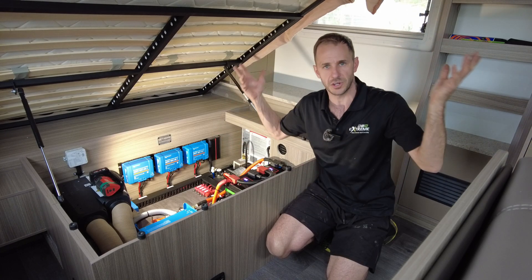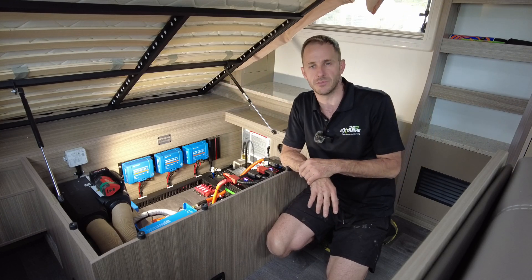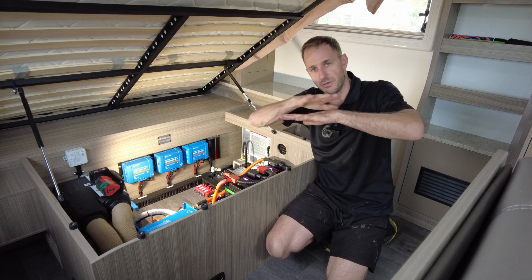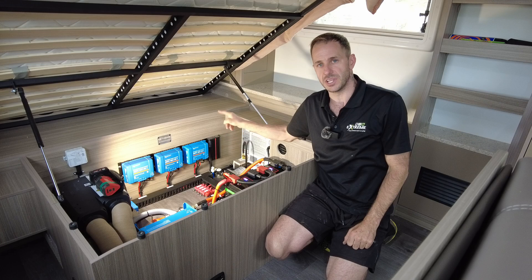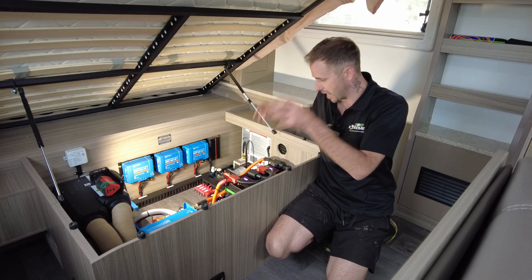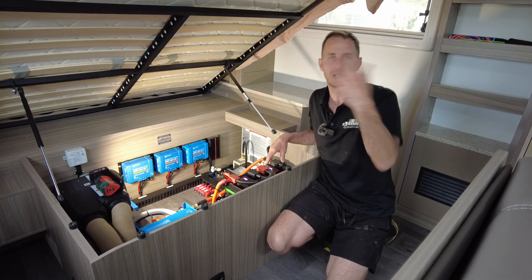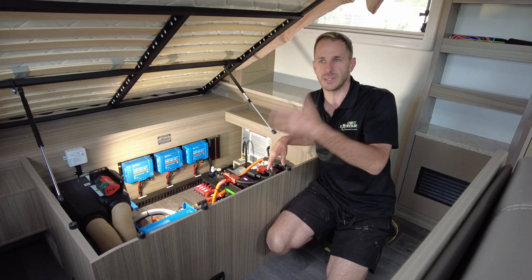Let's talk in watts. There's 1,320 watts on the roof — let's say 1,000 watts coming in from the roof because of efficiencies or it's not the peak of the day, say 10 o'clock. The second he runs that engine, another 750 is going to come in on top of that. So that's 1,750 watts to charge this almost seven kilowatt-hour battery bank. That's pretty fast charging. In two hours you put three kilowatt hours in; in three hours you put 4.5 in and some.